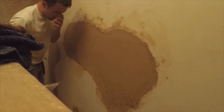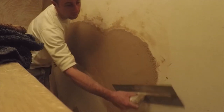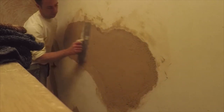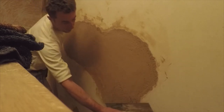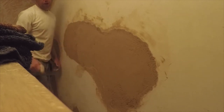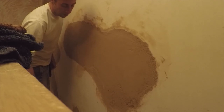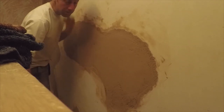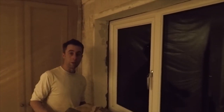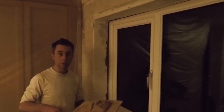After another 10 or 15 minutes it's time to do the final tidy-up — just stay light. Skim over it — that'll do. Because we're skimming over this anyway, it's just getting rid of any bits that are shooting out too far. Leave that overnight and then skim over it. Around the windows, when the PVA is dry, fill them in with the same stuff — Thistle bonding coat — this time just using a spatula.